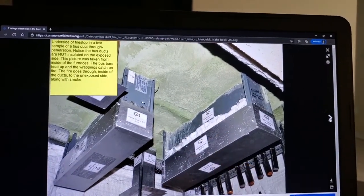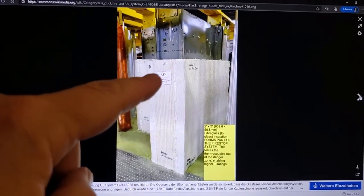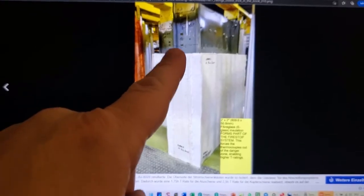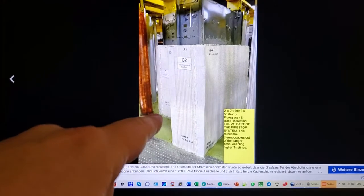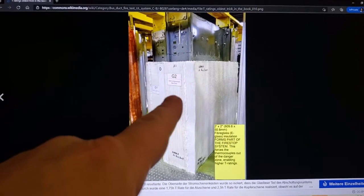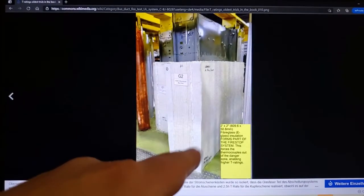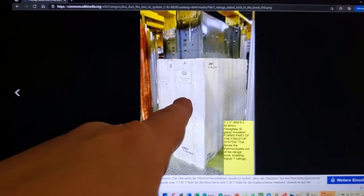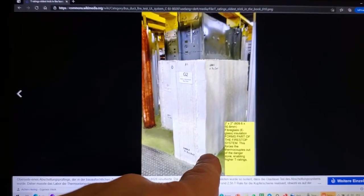One is aluminium and one is copper. And here's the trick actually, the oldest trick in the book. I put insulation right there, 2 feet tall. Right? This sticks out 3 feet total. This insulation sticks up 2 feet. Why 2 feet? That was an agreement with the test laboratory. Why? Because I had to defeat the thermal issue. Why? Because this is going to get awfully hot on the inside, right? At first, I wasn't going to do this. The hell with the insulation, I was going to fire stop the inside. Test lab said no. Why not?